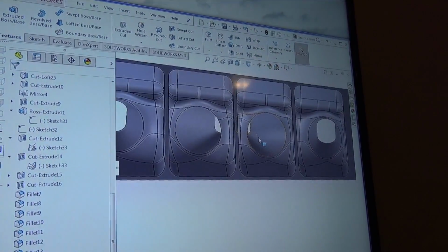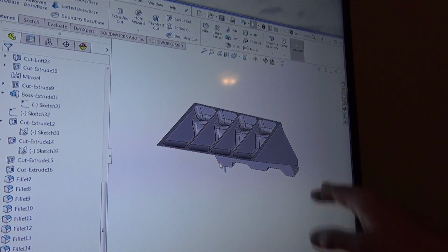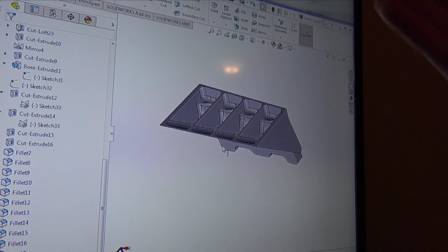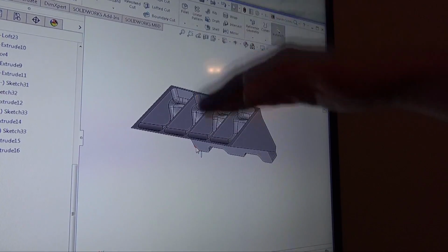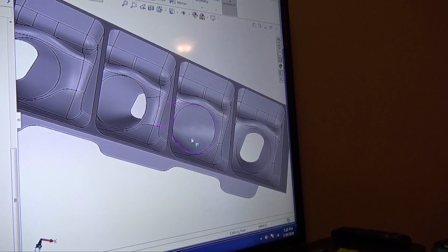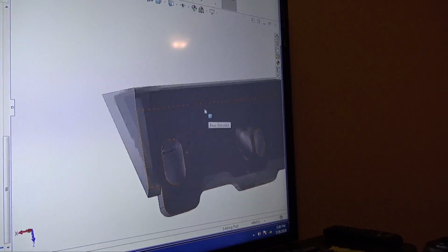It's not 100%. I still need to angle this back up. But what I'm planning on doing is cutting this down, putting a flange on it, and then having another flange. What I usually do is design the whole part and the whole transition in one piece, then cut it, and then put a flange on it. Then you don't have to go back and try to mimic all of those fillets and stuff, because it is very hard to do that. You can see in here the ports are all separated, so each port is going to have its nice cool charge air, and then everything's nice and CNC.